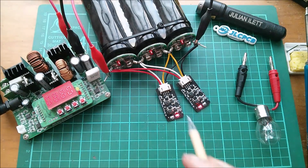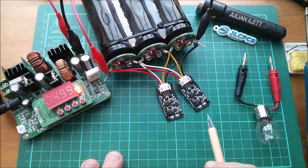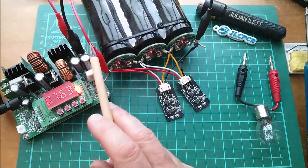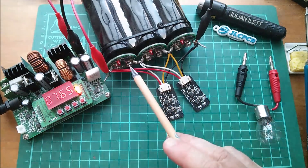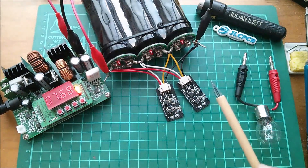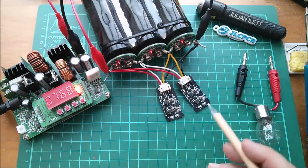When these lights go off I'll turn the power supply back on and see if the caps come up together. That's pretty much it — I'm satisfied that parallel active balancers work fine. Both have gone off, so turning the power supply back on at 500 milliamps. I'm looking for these three caps to come up together since they're all balanced, and for the balancer lights not to come on because the balancing has already been done. With constant current flowing through all of them, they should now be in balance and no further work should be required.